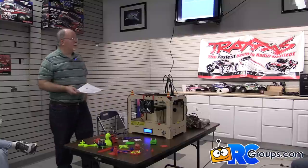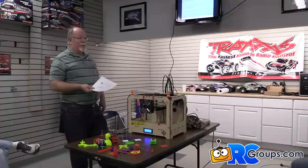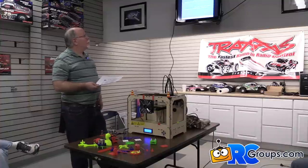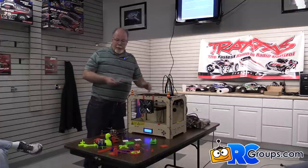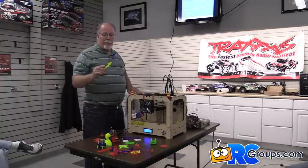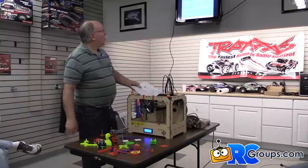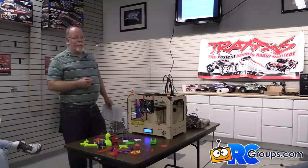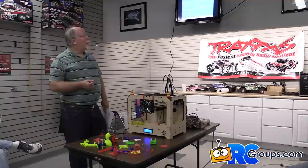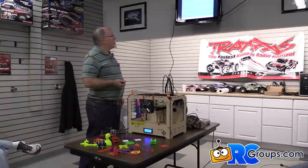The filament materials are the materials you load onto your printer to print with. The two main plastics are PLA and ABS — that's probably 97% of what everybody uses. This particular plastic is PLA; it's the easiest to use and it's pretty tough stuff. ABS is what most printers were using until recently — PLA is kind of a newer material and a whole lot easier, since ABS takes more heat.